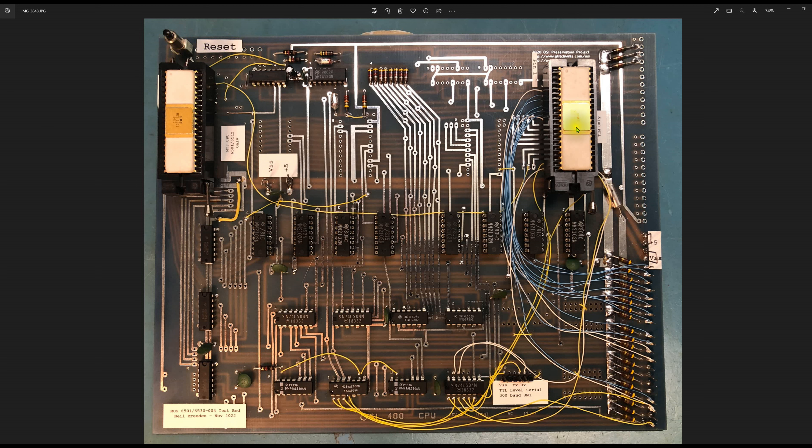Across the board we find the TIM chip — it is a 6530 RIOT. The ROM in it has been mask-programmed to implement the Terminal Input Manager, called the TIM. This is a simple software-driven UART that gives you the ability to look at memory, modify memory, modify system registers, and execute code. Both the TIM and the CPU sit in 40-pin zero insertion force sockets. Because I was impatient, I had put the TIM chip into a 40-pin solder-tail socket, and when removing it I actually chipped some ceramic off the package — I'm really disappointed about that.